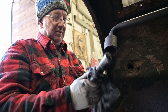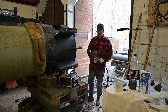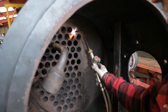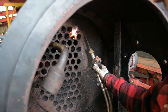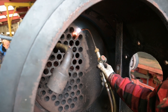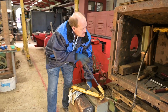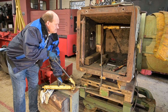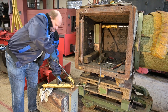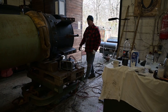Now we shall get my colleague to put pressure on the other end. We have the problem here that the smoke-box-side tube ends on the Neubauer 1992 boiler were simply rolled in too far. And that in turn means the tubes can't simply be driven out with a hydraulic press — they have to be bored out to reduce the wall thickness. With a lot of luck, such a tube then comes out in one piece.